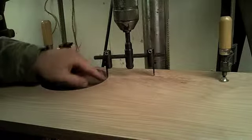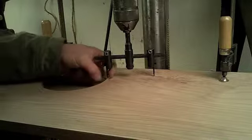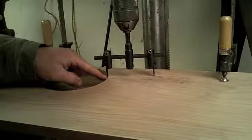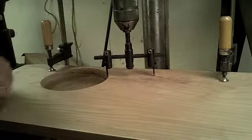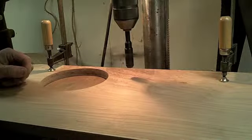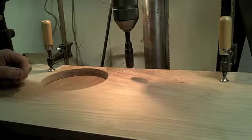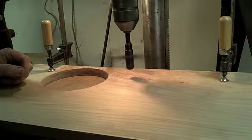that the cutter head overlaps slightly this other hole. While the actual cutting point never leaves the wood, the hole will overlap. And so as it builds sawdust, this will give it a place to vent that. I'm also turning it a little faster than normal, and not that I'm recommending this, it does make the project go a little smoother.